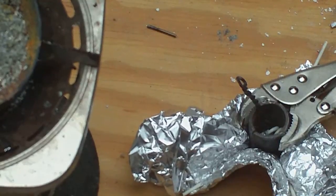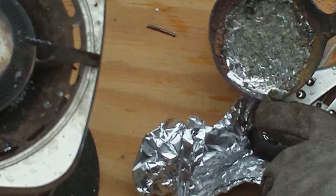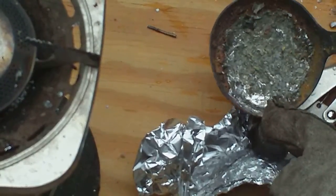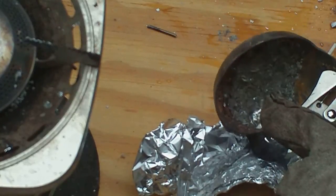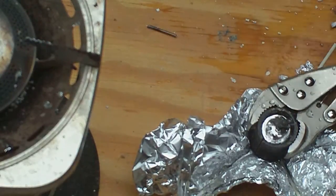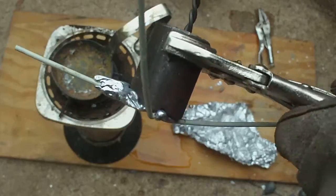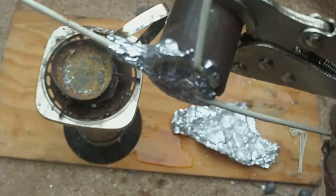Remember, we're going to just touch of water, a teaspoon of water in the bottom of that mold, and we're going to dump this lead in, then I'm going to cool it afterwards. I'll let that start to harden up at the bottom, and then finish pouring. And then go ahead and dump some water on it to cool it. As you can see, a little bit of it came out the bottom. But your tin foil and that little bit of water helps to cool it down and hold it in there.